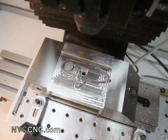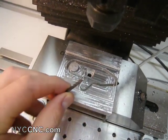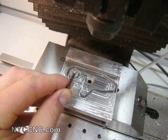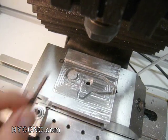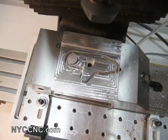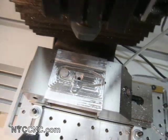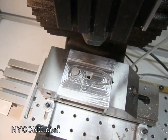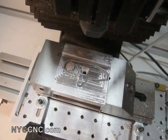Just a quick update — I actually paused and noticed that the very tip of my end mill started to have a little bit of chip galling or buildup on it. So what I've done is gone ahead and drilled a hole straight through, which hopefully will keep my end mill from having to plunge cut, so it can just laterally cut. That also removed a decent amount of material. We're going to see how this goes.